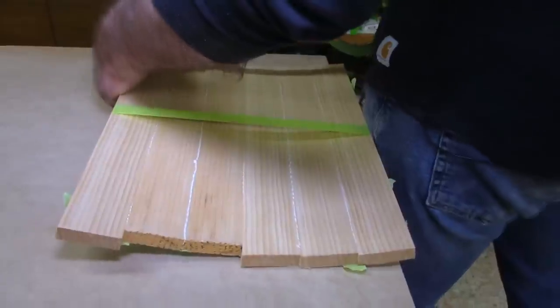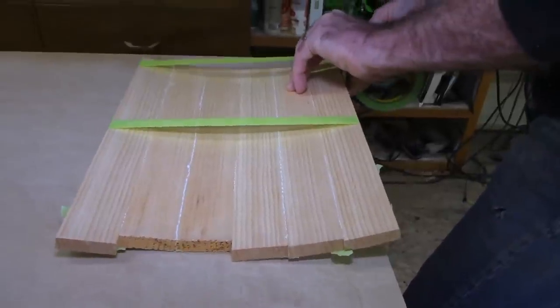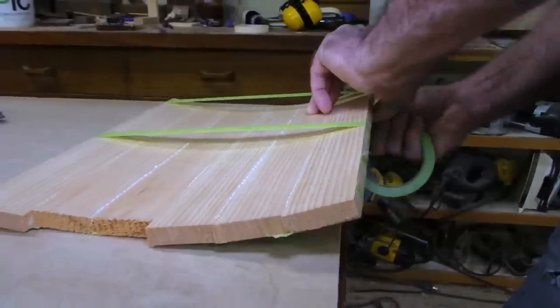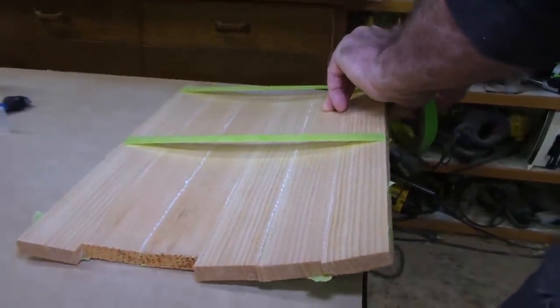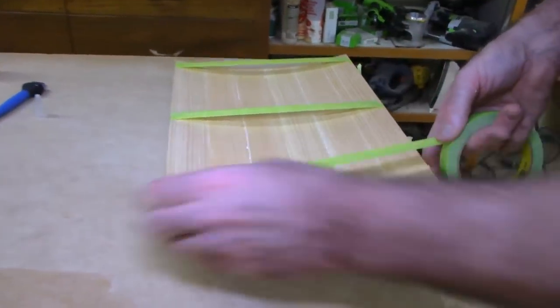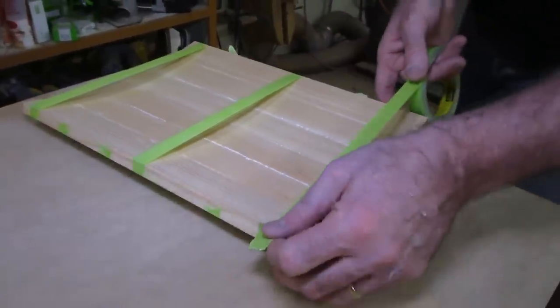You applied glue only to one side of the joint, Joseph's asking, right? Correct. Yeah. It got to both sides. You got to put enough that it's going to distribute, and you can see the amount of squeeze out I have, that we got a good distribution there. Put a nice bead down one side, brushed out, and then it did move. I needed to move faster, so one side did it.